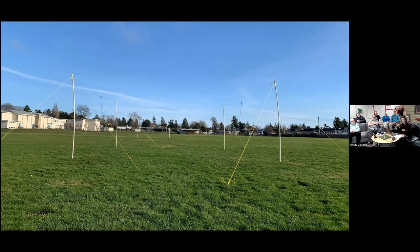But I got the original wavelengths of around 20 megahertz. I don't remember what that is. It's about 50 feet. You can do the conversion yourself. So the sides along here you can see, and I have a model too that I can show you in a second. Right here, this is copper wire, and that has been cut to exactly one half of the wavelength. So each section here is about 12, 13 feet. So in total, it's about 25, 26 feet.